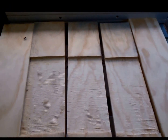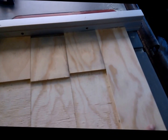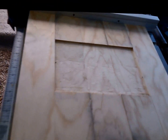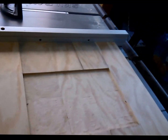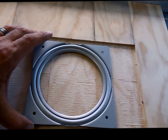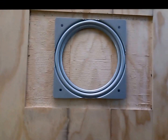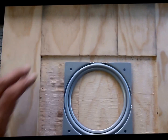So I went ahead, cut the recess. Simply just took 3 center boards, cut it out right around an 1/8 or 1/4 of an inch. So what we'll do is we'll put them together, glue them, clamp them. When it's all done, the Lazy Susan will get mounted down in the center, somewhere like that. I don't know, be centered a little better when I do it.